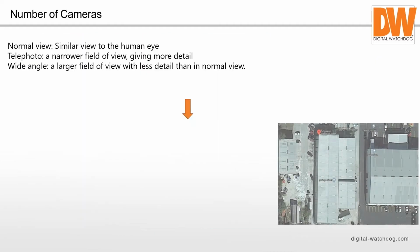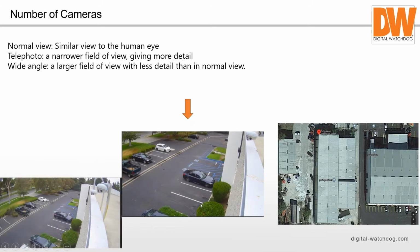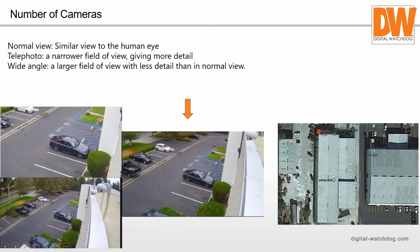But when you're looking at cameras, you may want something that's giving you a normal view, a human eye view, a super wide view, 2.8 millimeter, maybe a telephoto view where you're focusing in on a door or whatever. And so those are the spots where you say, okay, maybe at this site, because the customer's kind of not telling me what they want, I'm going to use more varifocals.